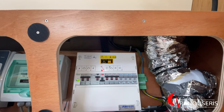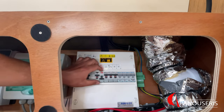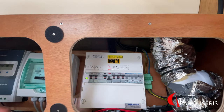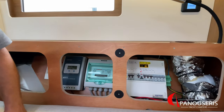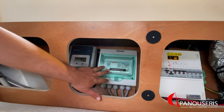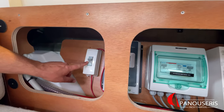About the boiler — if you want to have hot water through the shore power cable or when the generator is running, you need to open this switch right here, wait half an hour for the water to warm up, then close the switch and make your shower. Otherwise, while you have the engine running, you have automatically hot water through the cooling system of the engine. Here we have the breakers for the inverter, the display for the solar panel, and the switch for the solar panel.